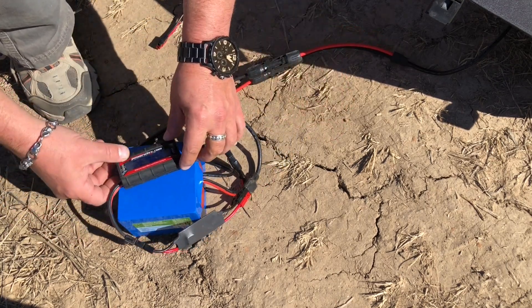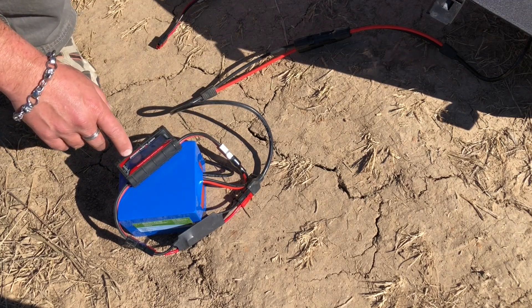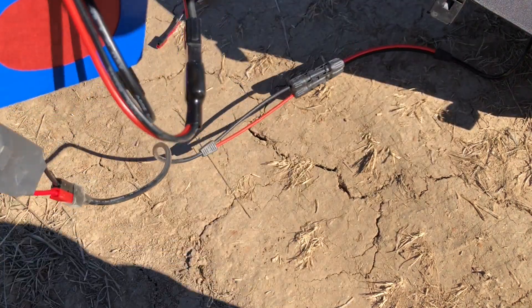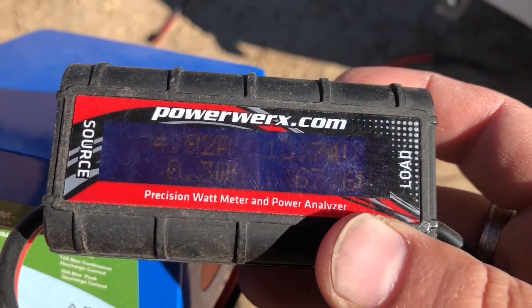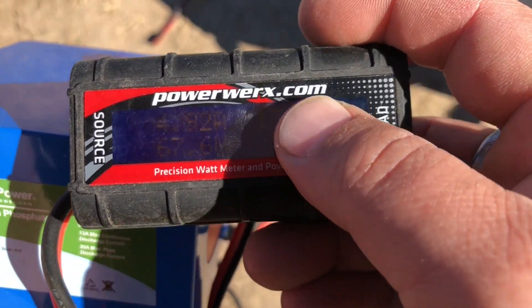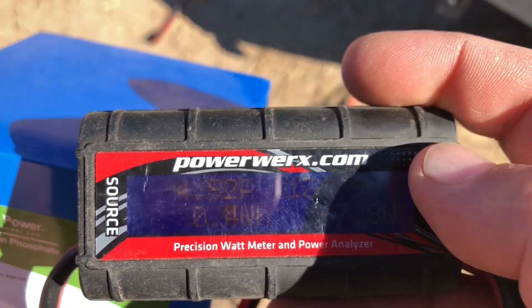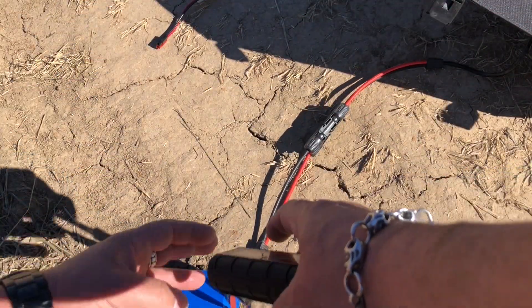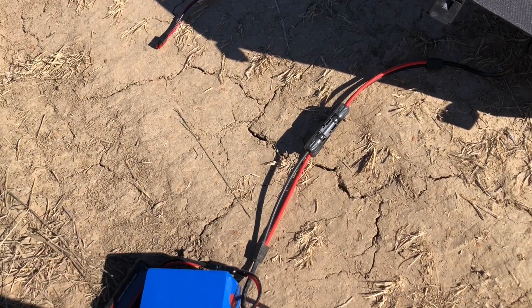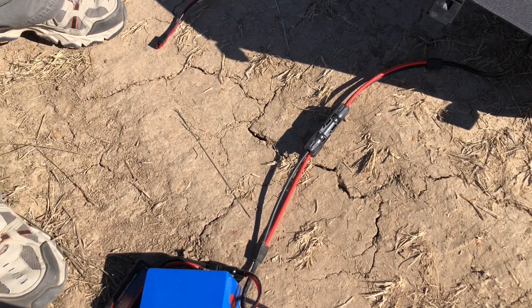So we've got our 12 amp-hour battery, and I'm connecting this watt meter to it so we can see what's going on — and then just a cheap solar charge controller and our solar panel. We're off to the races. We're getting 4.93 amps. Getting some good current draw out of that. So about 4.9 amps in winter. Not that it's really winter in Texas, but the sun is lower in the sky. To have that much current draw out of the panel in winter is insane. That's awesome.